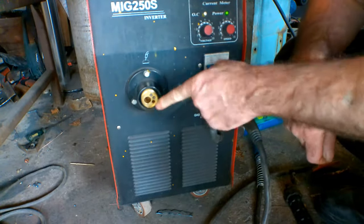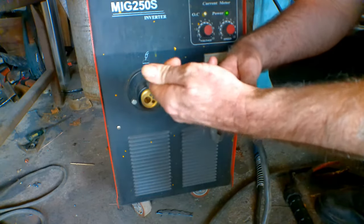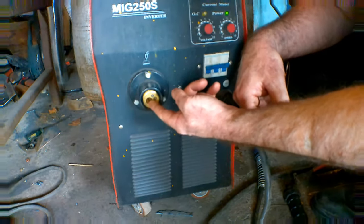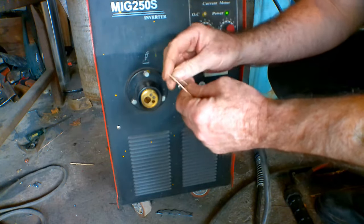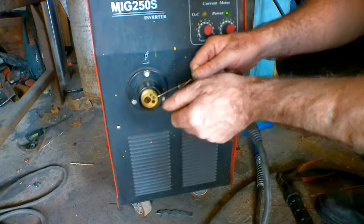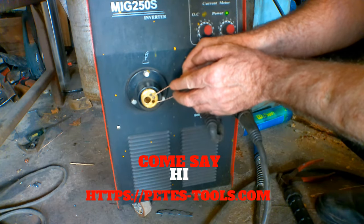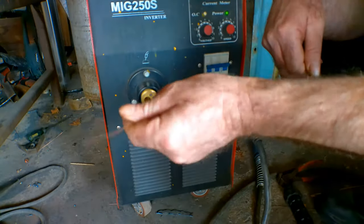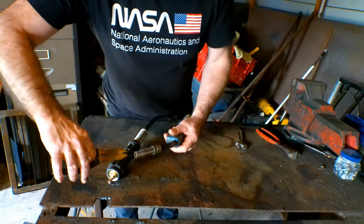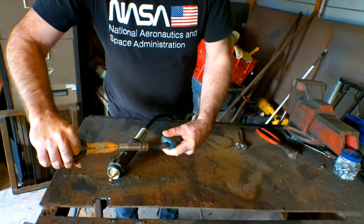Because we've got the torch off, I can't pull the trigger to see if this wire is going to come out of here. So I just do this: get a piece of old welding wire and be careful when you do this guys, because that wire can come out at a fair rate of knots and you can stab yourself in the finger. So we've got the wire coming out here — get your piece of wire, bend it into a U like that and just put a couple of little tips on it. You've got a contactor here and a contactor here — put these two bits of wires in there and just make it short. Keep your fingers away from the wire and we'll see if it's stuck in the liner. See that guys? So it's obviously the liner — we're stuck in the liner. We're stuck on this end and this end won't move either. You can hear it slopping around inside the gun.